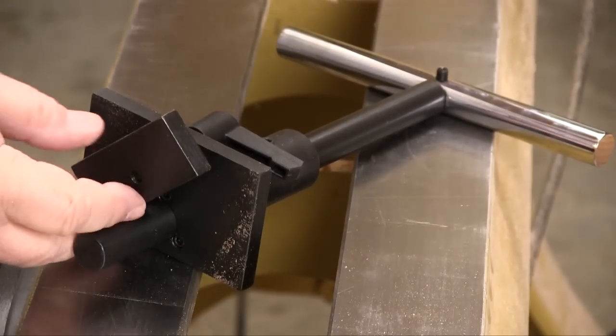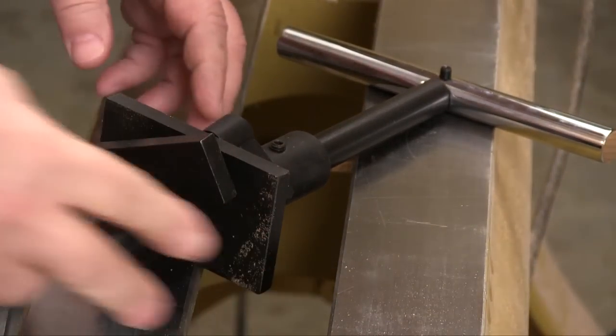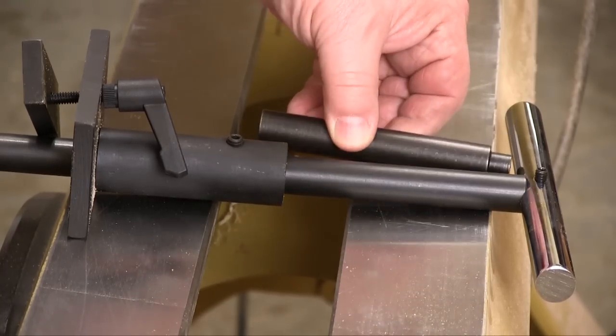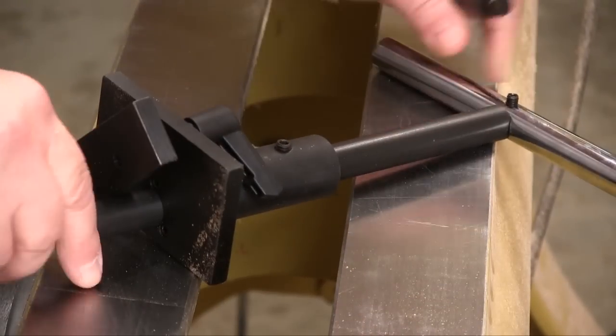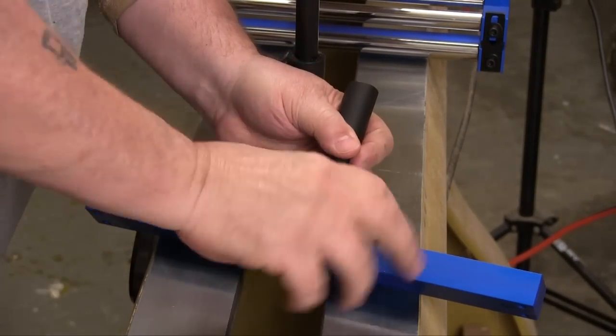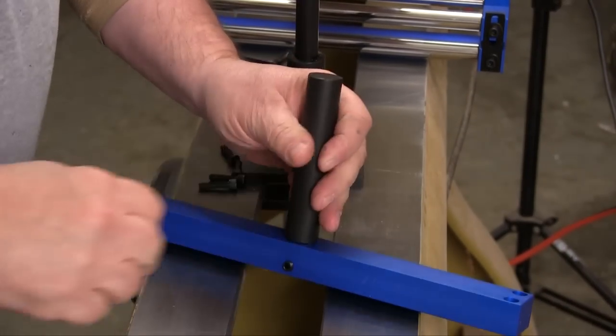This tool rest comes with the kit and uses this plate to lock between the ways of your lathe. It comes with two center poles so you can adapt it for use on smaller or larger lathes. The only thing you have to buy is a post that's compatible with your banjo for mounting the roller system.